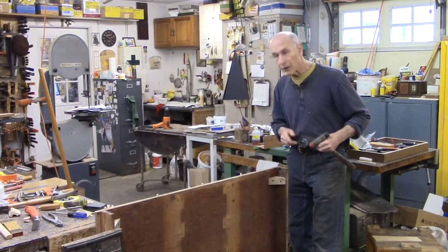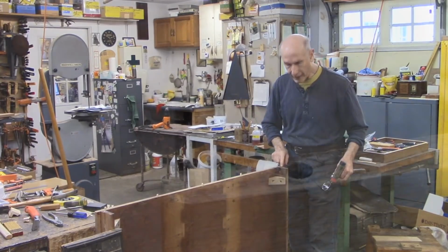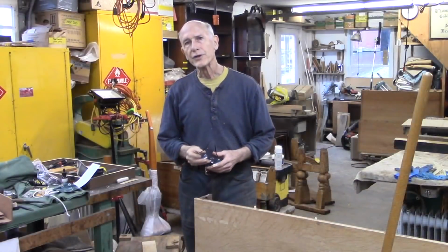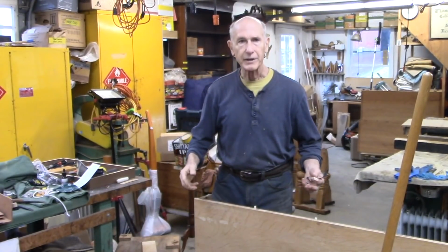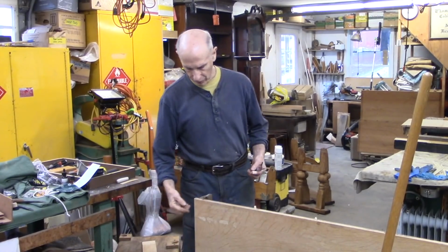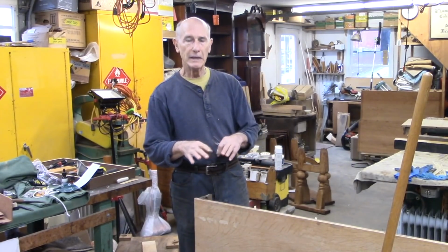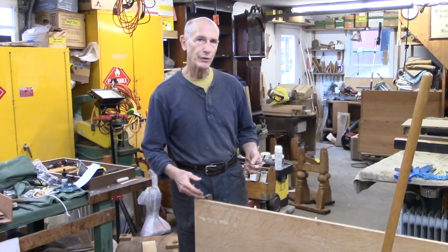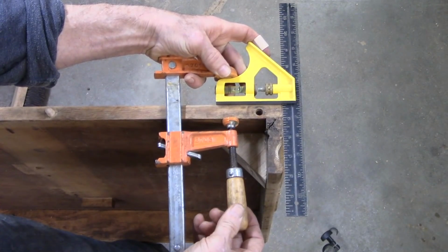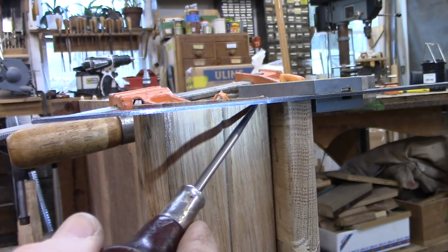Doing my last section here, and I remember these aprons are too long. They stick out past the center of the table. I noticed that when this came in. What's happened is very common. Over the past 100 years or so, this tabletop has shrunk, and of course wood doesn't shrink across its length, so these stick out. So the two halves won't come together. If you're using the table with a leaf, you wouldn't notice that, but I've got to trim these. So where I need to cut is on the underside of this blade right here.